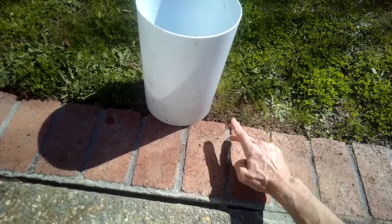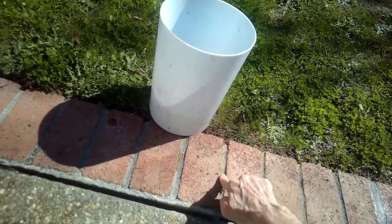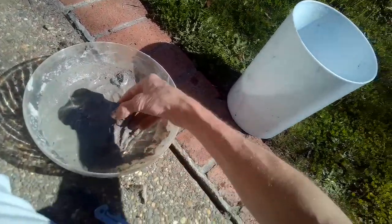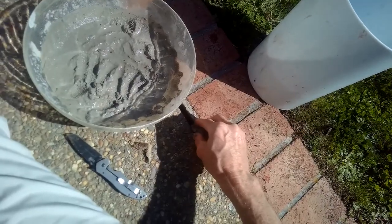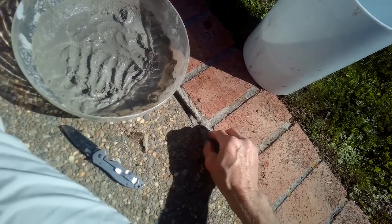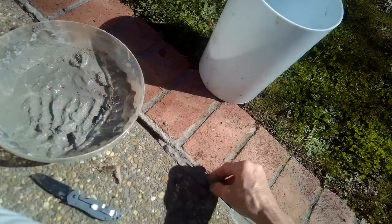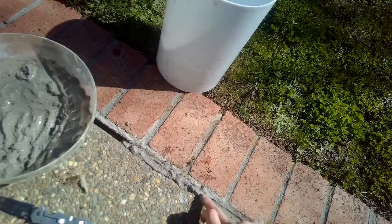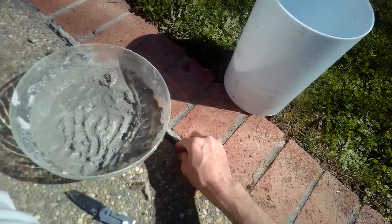This is a really minor patch, just trying to get rid of that depression. Add a little water to it. These bigger ones — take a bigger pinch of material and that's going to fill it more rapidly. The technique is to start, then push and pull at the same time. If that material goes down at least half the distance of the brick, that would be great. If it's just a quarter inch or so, it's not that strong and more likely to fail — you'd be back here within a year doing the same procedure.